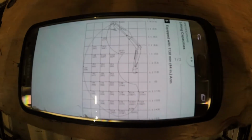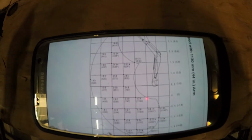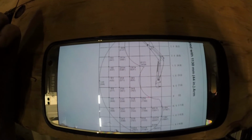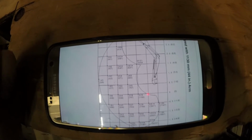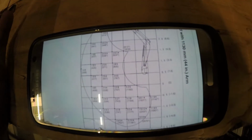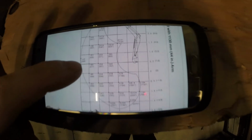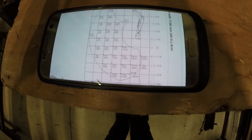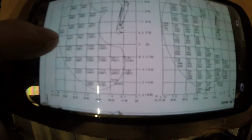So that means if I have an 18-inch bucket, a foot and a half, that's around 100 to 120 pounds, say. So then the bucket's probably around 100 to 120 pounds. So I'm well within that 328 pound lifting range when I'm farthest extended. So that should be fine. And then you can go towards over the rear. The farthest is 500 pounds. So I'm well within that range.